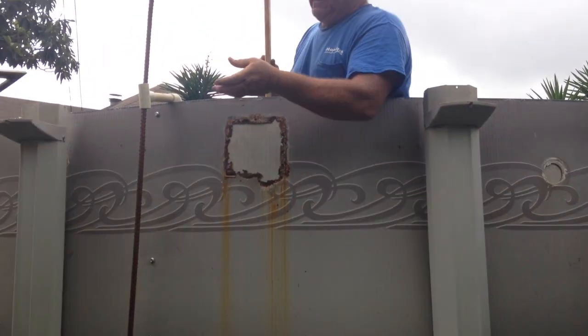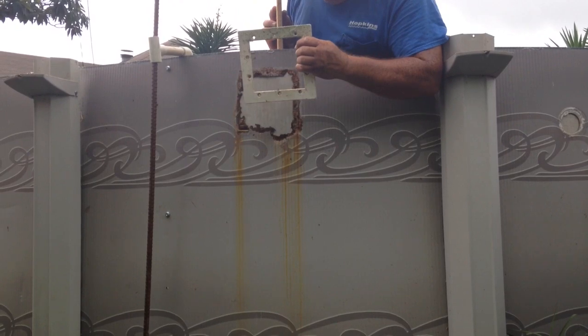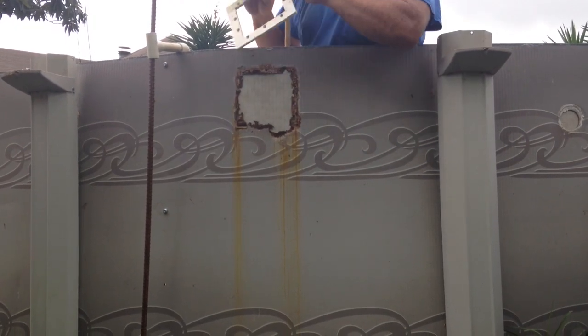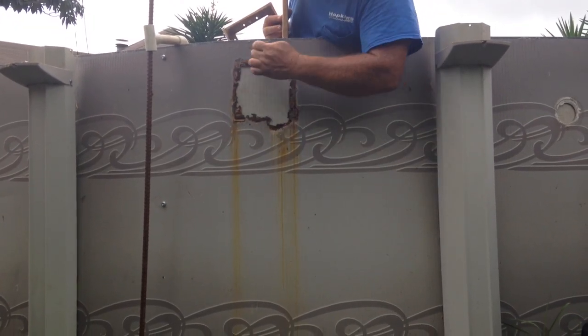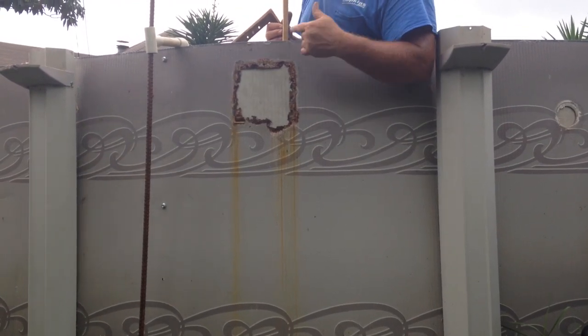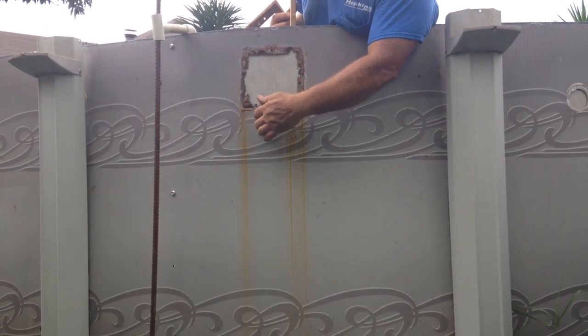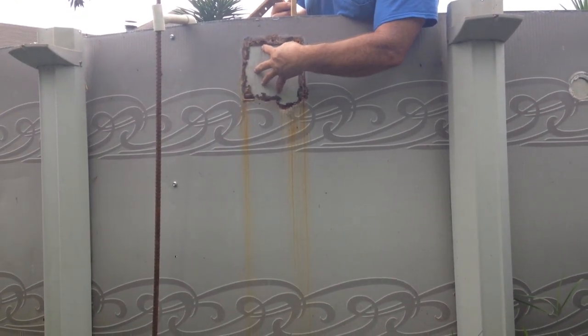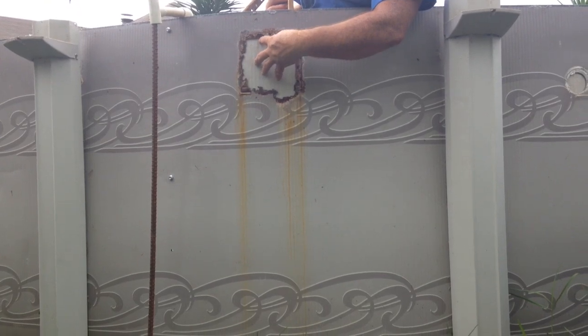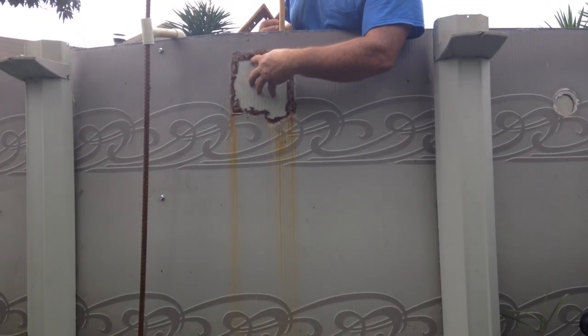With the skimmer faceplate that you removed from the pool, in this particular instance, most of the bolt holes, you can see they're all corroded out. Now, if they're not all corroded out, you could take your drill bit that we provide for you, and you can pass those right through each one of those holes, aligning up all of the holes where they go with the skimmer. This particular installation, we're going to freelance this one because this one is pretty corroded out.